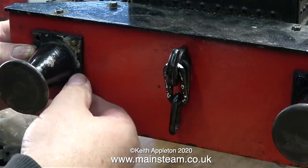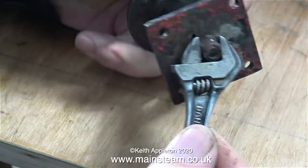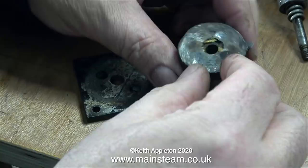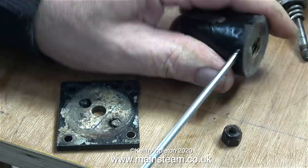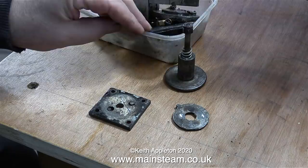I'm removing the right-hand side one on the front buffer beam — or the left-hand side if you look at the locomotive from the front. There's a real hodgepodge of brass and steel bolts holding this thing together. As a general rule, it's not a good idea to lift a locomotive by the buffer stocks in case they break off in your hand. Looking at this one I'm thinking: major bodge repair attempted. It's sort of welded in an odd sort of a way — I've never seen anything quite like this. It needs remaking so that it's strong. At this stage, it isn't official whether I've got the job yet — I need to look at the locomotive thoroughly and then give the customer a fair price for fixing it. This is not a good start, and I'm not impressed at all so far.